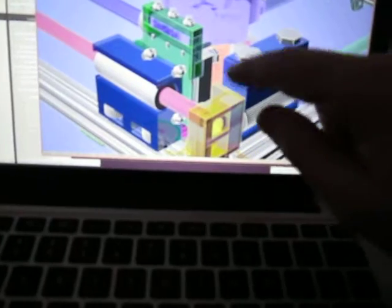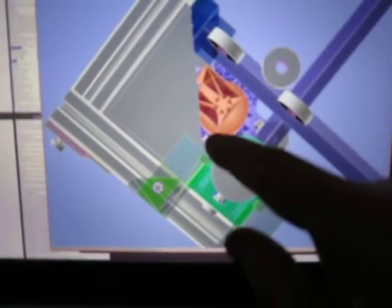So this green part, that's the fan holder from the version 2 with the Core XY, that is going, and I'll be replacing that. We've actually now got plenty more room underneath inside here to put these fans possibly down on this right hand side here, and yeah, there's just enough room to fit the fan on there, and it will be able to fit the one for the hot end. We'll point that way at it. I'll split a 45-degree angle, double 45-degree angle, so it will be that way at a 45-degree angle, and also that way at a 45-degree angle.